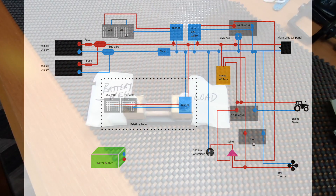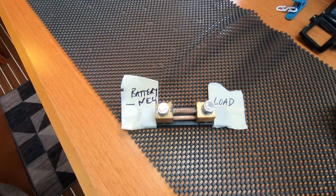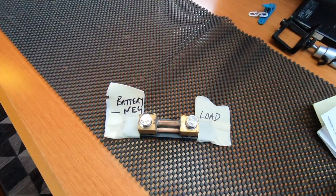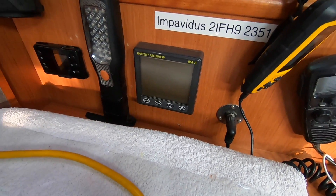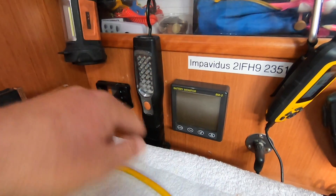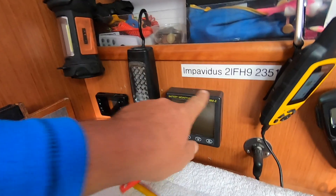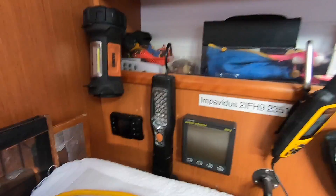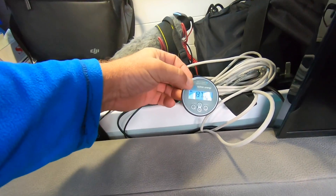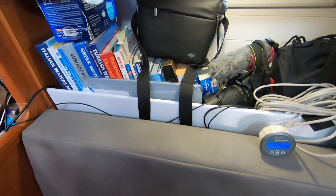The old shunt is out - I've just marked it up so that if I use it somewhere else or sell it on, we know which way it goes round. The new Victron shunt is in and plugged in. That's the old battery monitor which is now dead, and the new battery monitor is going to go in here. I've got to make a panel up similar to the other panel - it will hide the holes from the previous stuff and make it look a bit better. I've got to bring the new battery monitor, which is temporarily hanging here and has yet to be programmed, with this Cat5 cable round the back and through to the other monitor.